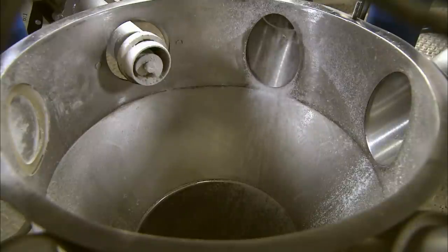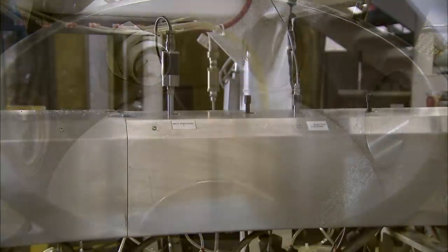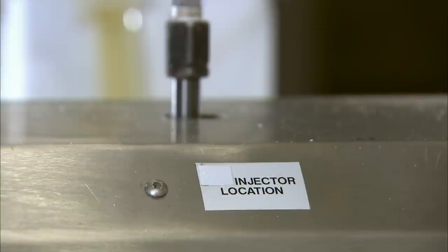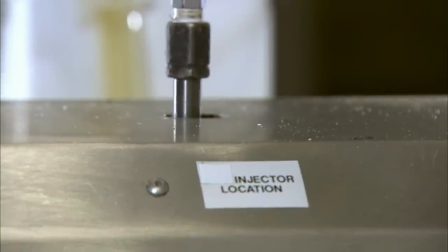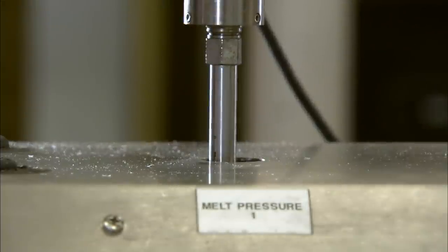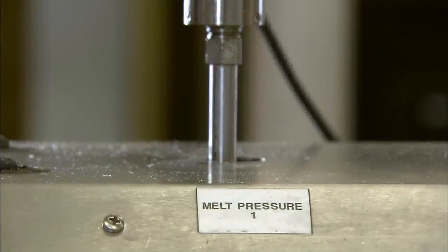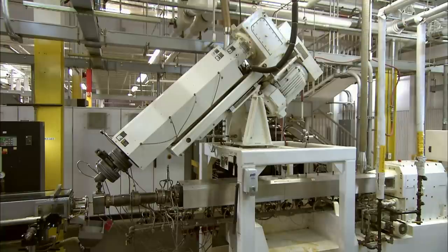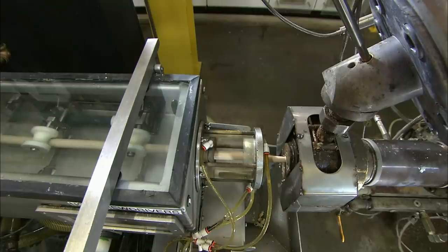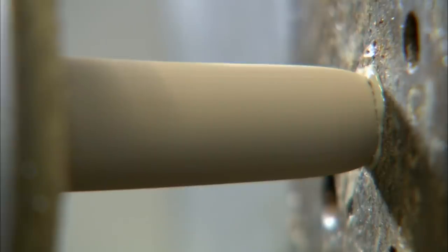The blender feeds a specially designed dual extrusion machine. The machine melts the foam mix to a liquid state, then injects carbon dioxide. This produces bubbles, which create the cellular structure of the foam. The liquid foam enters the machine's horizontal extruder, while elasticized polymer enters the machine's angled extruder. Both extruders squeeze their materials through the same shaping die, which outputs a continuous rod of skin-encased foam.